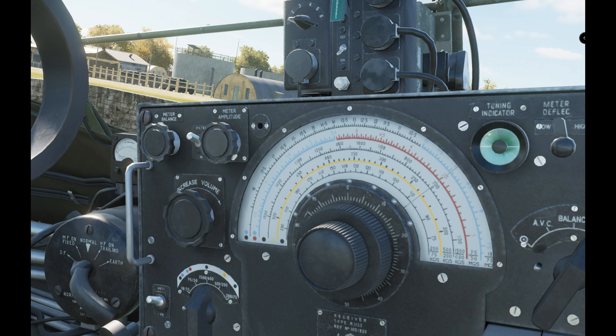So why didn't we pick it up last night? It was working, but it was on a higher band — higher frequency. That means the wavelength of that frequency was actually very fine, so you would need to make very, very fine adjustments to the tuning dial to pick it up. In my personal opinion it's way too high. I'll show you that in a minute. The one I just tuned was 700 kilohertz; that one was around 10 megahertz.